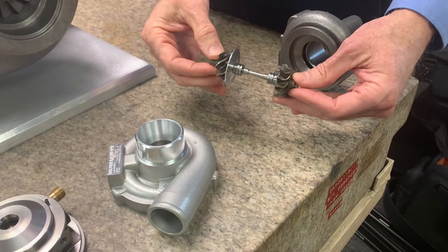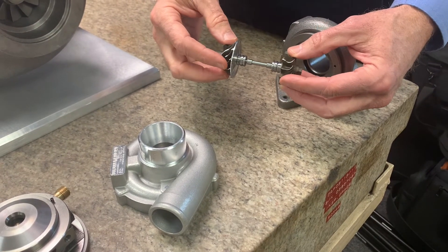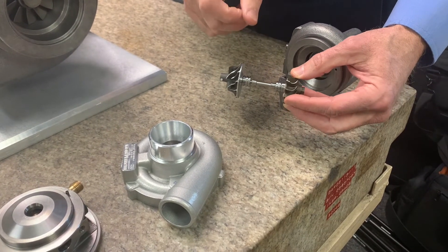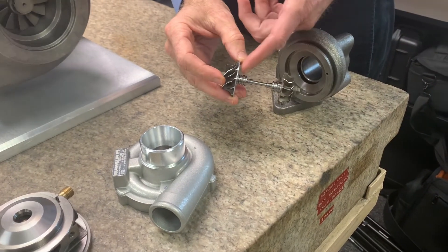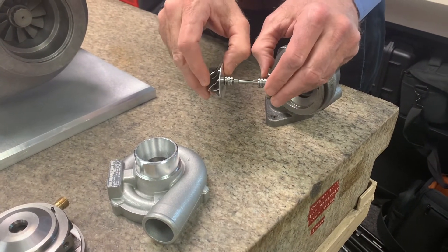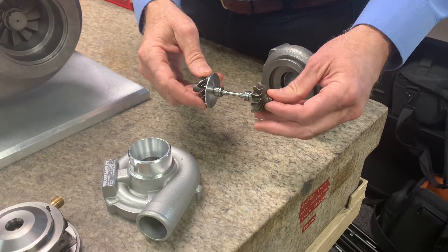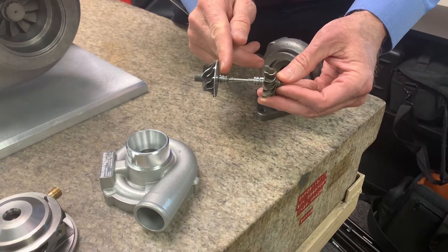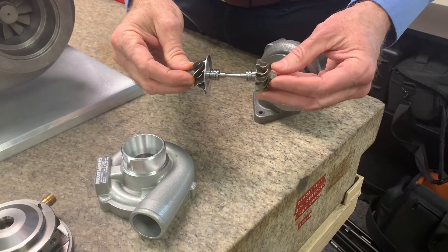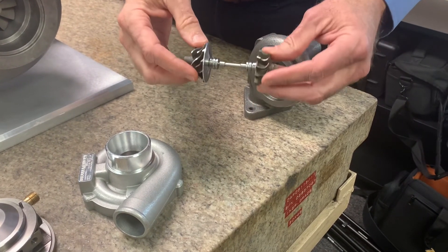Another big aspect is that we can reduce the tip clearances in these machines. As they spin faster and go to higher pressures, tip clearances become more important on a cube function. With really small equipment like this, being able to reduce those tip clearances through precision engineering, running directly on the back of the compressor and turbine wheel, and sealing those cavities right there — we can also eliminate the thermal growth you'd normally have from a thrust bearing that's a couple of inches away from the compressor. That's hundreds of degrees of thermal gradient, resulting in tens of thousandths of axial growth. We can essentially eliminate almost all of that and make these small machines much more efficient.